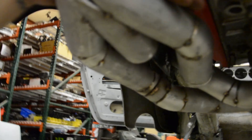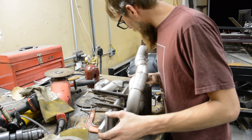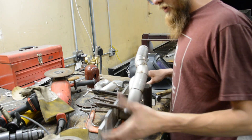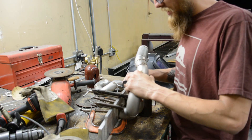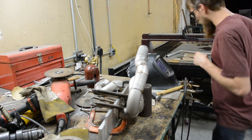Here it is mocked up. You can see there's a bit of clearance in there, so that's good — I think this will work. So now we can start welding everything up and then weld the middle pipe in. Got everything mocked up. I've got basically two pieces of aluminum — this is half inch, this is three-eighths-ish — which suck the heat out of this part.